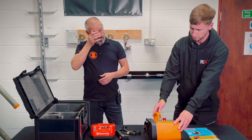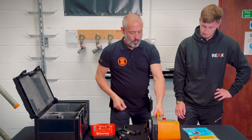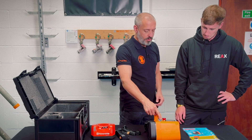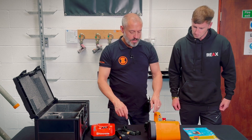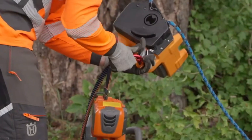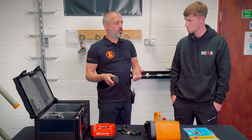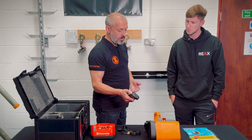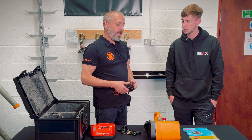One of the key things that stood out was last time we had the twisting handle to operate it, and now there's a slight change there as well. So when we're on the ropes we'll show how we load the rope. When you close the gate, push it down firmly, make sure both buttons are on and turn her on. It's a button here — a thumb wheel, forwards and backwards. And what I think is a really nice touch is we have exactly the same thumb wheel on our remote control. So when using the remote on an ACX, if you wanted to lift something remotely at the fastest speed, you start and stop at that fastest speed, which is maybe not the best thing for your anchors or getting your knots untied afterwards. Whereas with the ICX, I can start slow and then build up my speed, and the same when I stop — so if you're moving heavier loads, that's obviously a lot kinder.